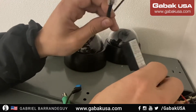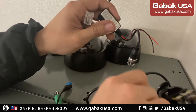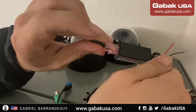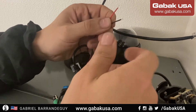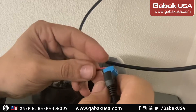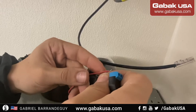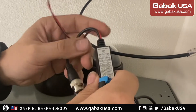If you run ethernet cable instead of coax, when you have to replace a camera like in my case, you don't have to go to the power supply and turn it off. When you have the coax live — even at low voltage — if the connectors touch each other, they're going to trip the breaker, or in this case the fuse will blow. So always before replacing any camera, either remove the fuse or turn off the power supply.